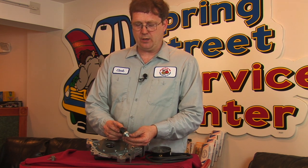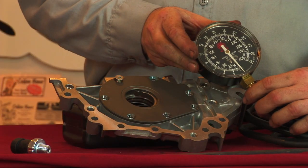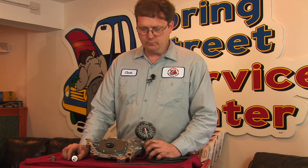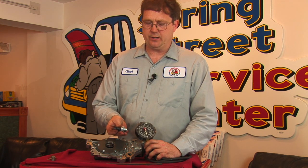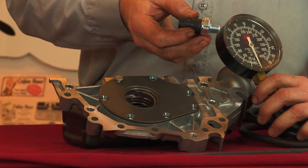What we would need to do first is to actually take a wrench and remove the oil pressure sender, and then with the proper adapters, actually install a manual oil pressure gauge and take a reading to find out what the real oil pressure is. An oil pressure light coming on or a low reading on your dash gauge is caused typically when one of these senders senses less than two pounds per square inch, but it can also happen if the internal diaphragm leaks. So that's why we're going to hook up an oil pressure gauge and find out what the pressure really is.